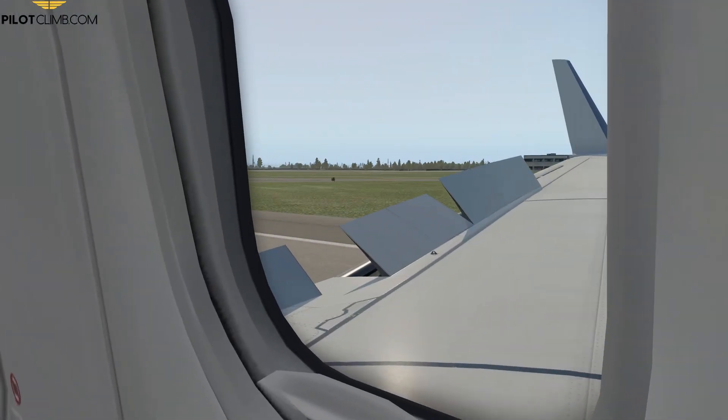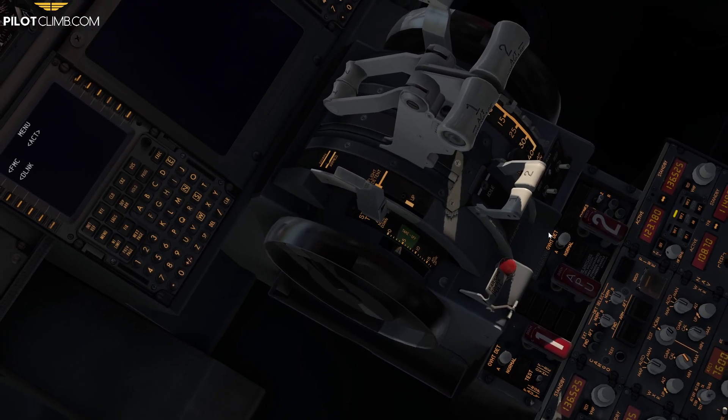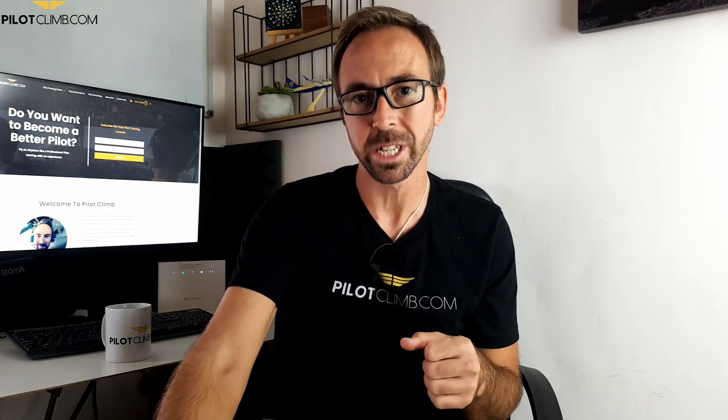If we are flying and we have a shortcut so we need to reduce our altitude very quickly, we need to extend the speed brake all the way up to the flight detent position. The flight detent position is the maximum extension for the speed brake in flight — you don't go beyond that. The Boeing 737-800 has a safety guard that blocks the lever from going to the up position. During flight, it's either down or in the flight detent.